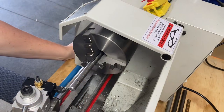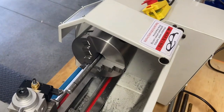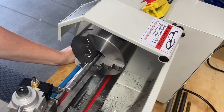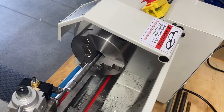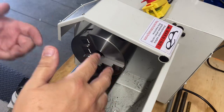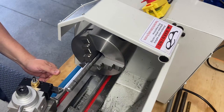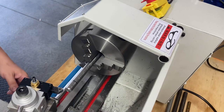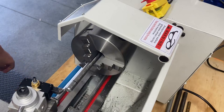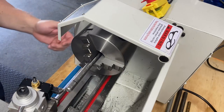I set this up coming in from the opposite direction. I'm sure so many people are cringing at the way I'm doing this, but I'm just trying to learn. If I see something super dangerous, I'm going to rethink it - you can get hurt with these machines, you've got to respect them. Coming at it from this angle will keep my hands and knuckles and cross slides away from the spinning jaws. I'm going to bring this in and put a slight taper - it doesn't have to go all the way back to that one-inch mark, but I want somewhat of a taper on the end.